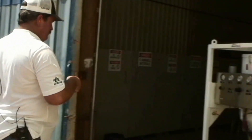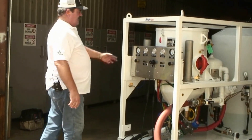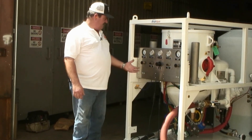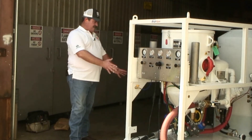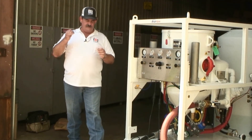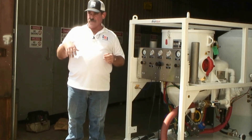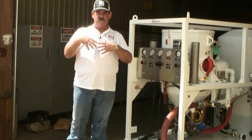The next thing we want to show is that this Amphiblast is exactly what it says — it's amphibious, it's wet or dry. So the next step is to take the same system and crank both nozzles up for a short duration of dry blasting. To do so, I'll take the unit back to blast mode; everything else stays the same, with the exception that you might have to add a little bit more abrasive. We'll start our nozzles up and make that determination.